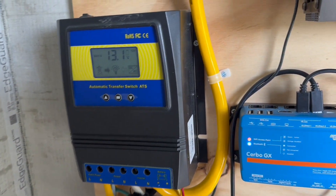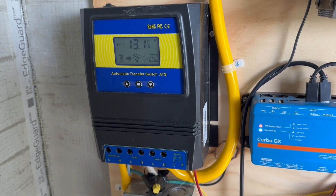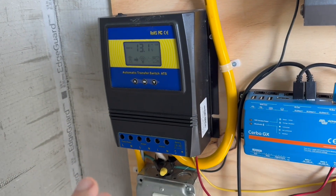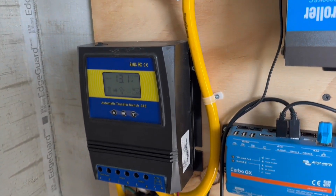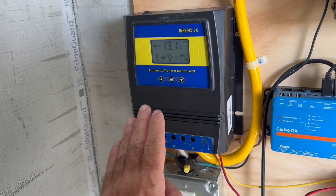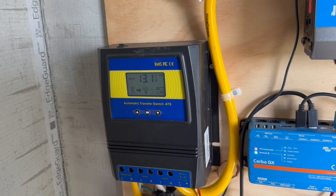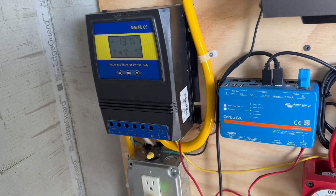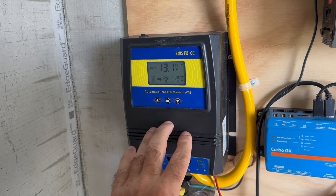Yesterday that ran until after 6 p.m. I was moving the solar panel a bit to get better sun, but it's great. It's going to kick on in a few minutes and then this will run the boat and keep the batteries topped off all day until the sun goes down. After that, once the batteries drop down to 13.4 — which I'm using as my cutoff, well above their threshold at around 80 percent — I don't have a desire to run them all the way down.